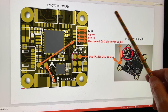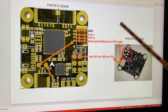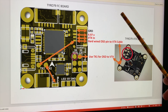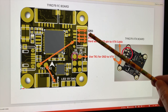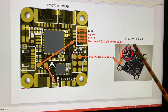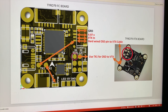What I did was get a voltage regulator, connected it to the battery, and set it to about 8.94 volts — I think that's what people suggest. Now I'm running voltage directly to this pin. So what I've got is this pin and this pin for power coming from the battery regulator. Then for the VTX signal, I went to the VTX on the other side of the board and ran a piece of wire from there. Since there was no pin for it, I still used this connector but clipped the wire and ran it over to TX1, and then it was configured in Betaflight.